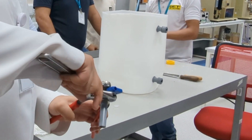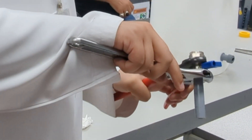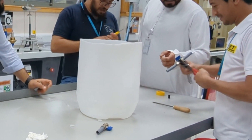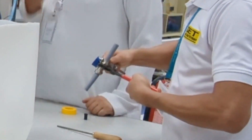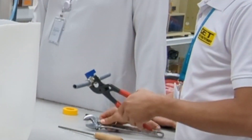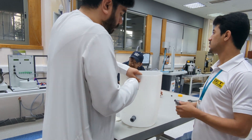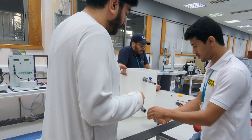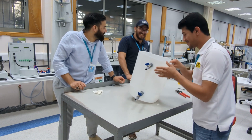After that, it was time to connect the PVC pipes. We first connected two pipes on each side of the ball valve, where one side will be connected to the jug through the union, and the other will have the balloon attached to it. Now, we connect the pipe to the union in the jug. All the piping connections have been completed and we made sure that all the valves are closed.